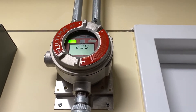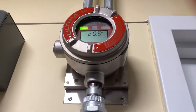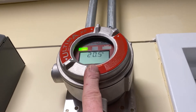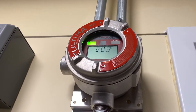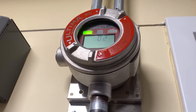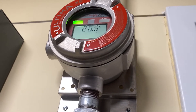I really wanted to catch the sensor acting up, but it was going in and out of alarm, causing the strobe to go off. Numbers were changing very fast, going up to like 21 points, often down to 18, down to 17 — so it changes very quickly. Anytime it's doing that, it's an indication that the sensor tip needs to be replaced. So we're going to go through that process today and the calibration.